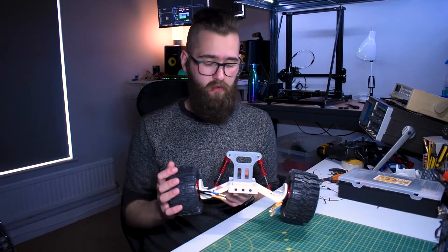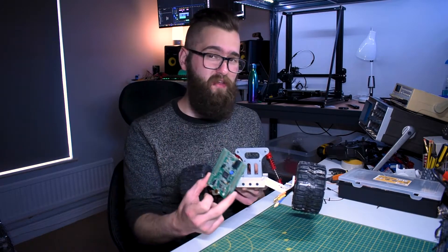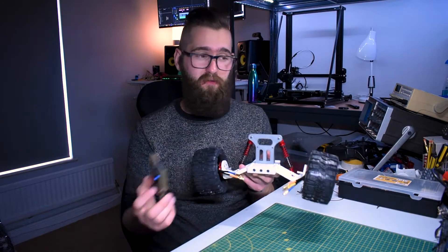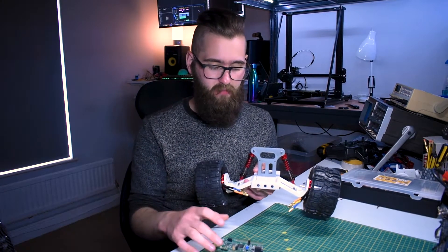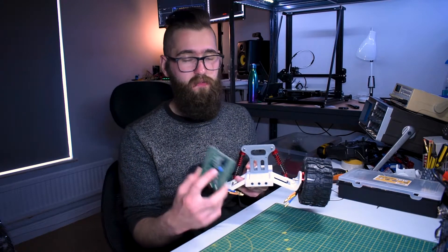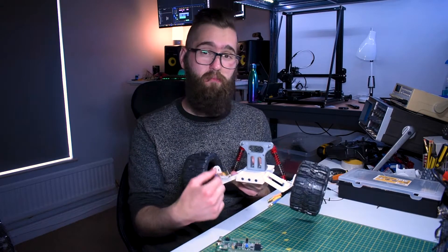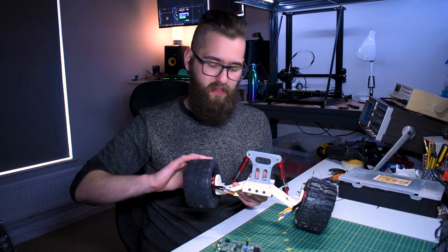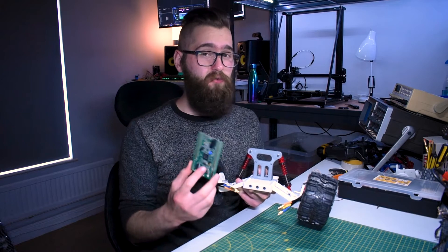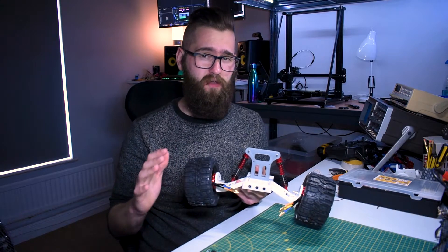The main reason I printed this for the moment is just to be an electronics test rig. For the next two weeks I'm going to be hooking everything up to the STM32 board. What I'll be doing is reading the receiver signals into this board and then using the chip and some programming to control the output to the ESCs and the motors. With individual control over each wheel, I'm going to be able to do some really cool stuff with this STM32 and I'm super excited to share that with you guys.